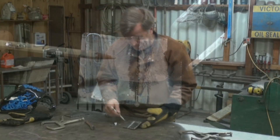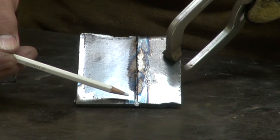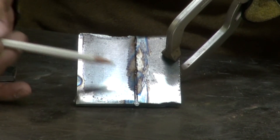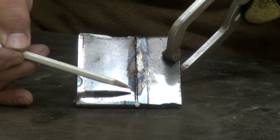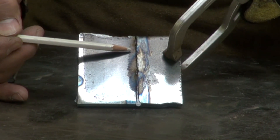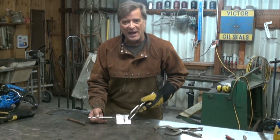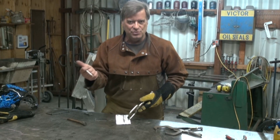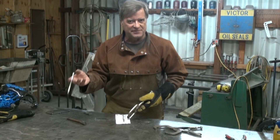Let's look on the other side. This is the run I made at 19.6 and this is the one at 20.6. If you look real close, you'll see the bead actually did get all the way to the bottom at 19.6, but at 20.6 it didn't. Now how did that work? More practice — that's what I always say. Just more practice, more learning. Play with the settings, figure out what works for you, for your location, for your job, with your machine. They're all different, just like people.